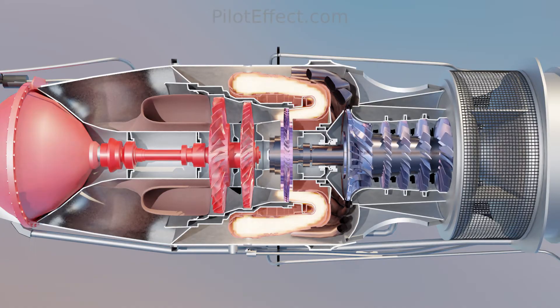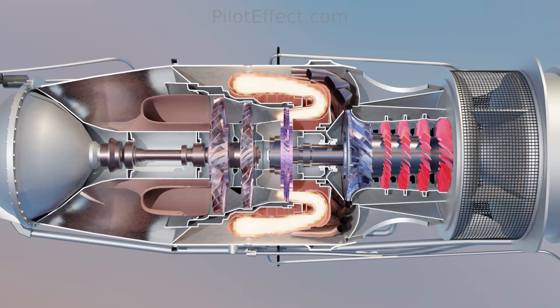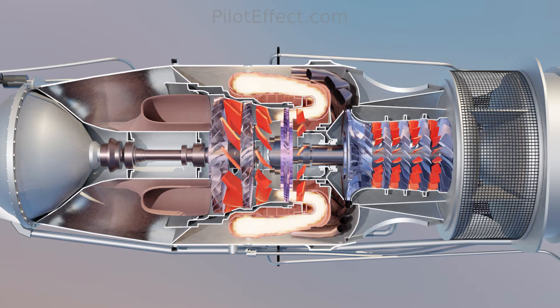Let's look at the whole process from start to finish. Air enters through the intake at the back of the engine, then flows to the compressor. The compressor consists of three or four axial stages depending on the engine model, and a single centrifugal compressor stage. After each set of rotor blades is a set of stator vanes. Rotor blades provide kinetic energy to the airflow, and the stator vanes convert that kinetic energy to pressure before passing the airflow onto the next stage.